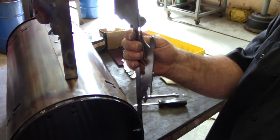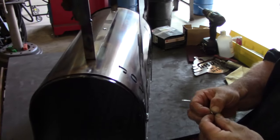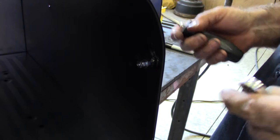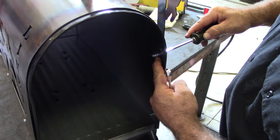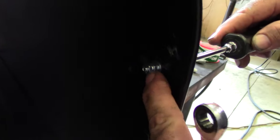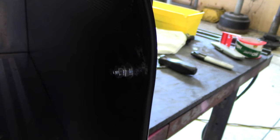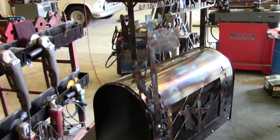Okay, so anyway, now I've got that where I like it — I like it where it'll hold itself in any position, just nice and kind of snug. So now what you want to do is take the other lock washer and put it on, and then the last nut. Basically what you're doing is you're building like a lock nut where it won't come off. I found with lock nuts on this going back and forth, they didn't work as well as an actual lock washer. So that's why I changed to doing it this way instead. So when I'm tightening it now, I'm only on this nut and I do have my screwdriver on because it will turn on you a little bit. Anyways, I just tighten it down to where the other nut starts to turn — your lock washer's tight. Presto, you're done. And there you go — it goes up and down. Like I said, it'll stay in any position. And now you have a complete mailbox.